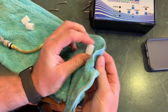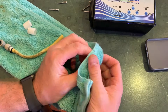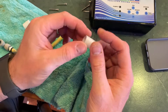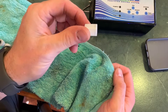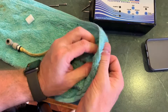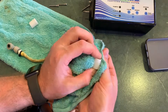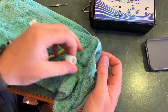You can see the gunk inside the pump head came off with just a wipe of the towel. Some of these rollers tend to get a little bit stickier — the one in my kitchen gets stickier; I think maybe a bit of oil vapour from cooking gets into the pump head. But you can see it just needs a bit of a wipe down to get all the gunk off the roller. I normally just blow through the centre because sometimes you get a bit of dust build-up in there. All three rollers are almost identical — they've each got the same little wear pattern where dirt has been rubbing between them and the hose.